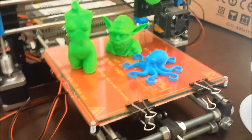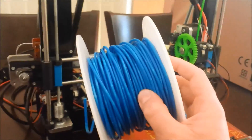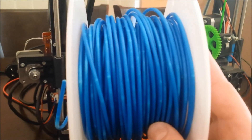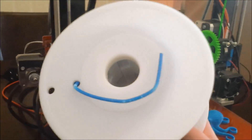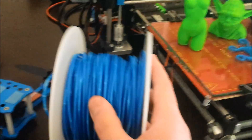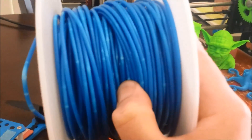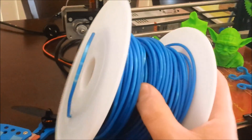Regarding quality of ABS plastic from Chinese manufacturers of unknown origin — this is the blue ABS I've been printing with. I've gone through over half of it, and as I've gone down the reel I've noticed blemishes or stress marks appearing. I can only surmise that as I've gotten closer to the spool, the bend radius of the 3mm ABS has just been exceeded, and you can see the kinks that have started to appear. The deeper you go, the more there are.